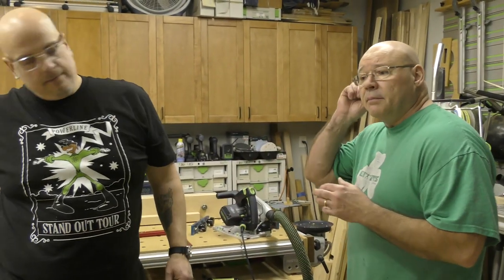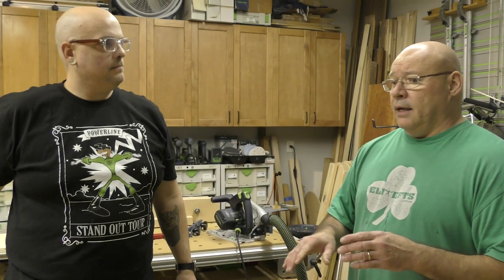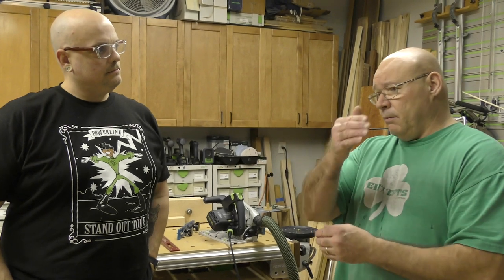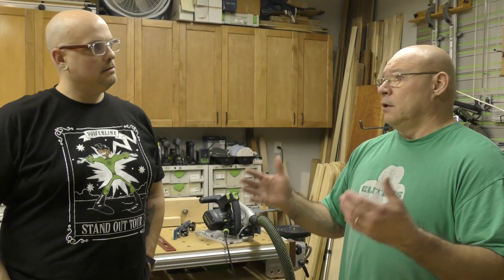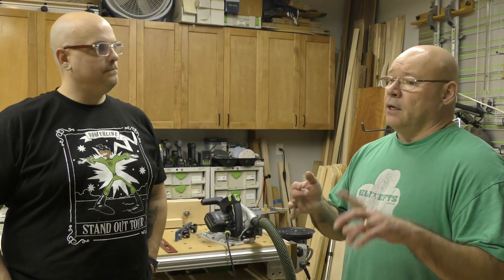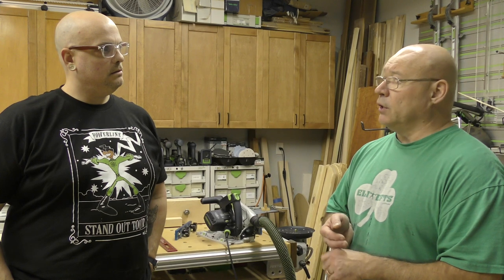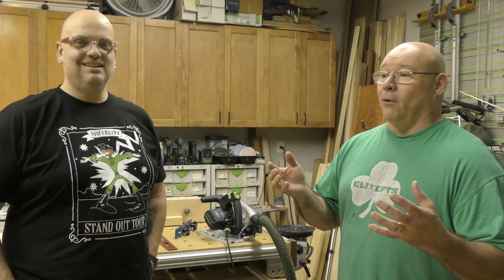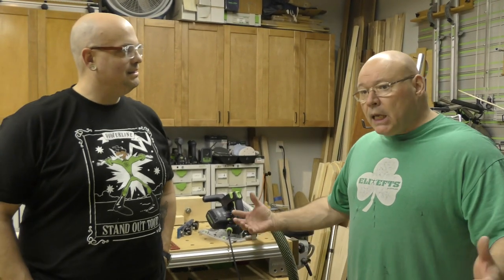And I'm gonna say this 100 times during this video. It's the process of making your panels. Assembly is gonna be absolutely nothing. The time consuming part is perfect parallel rips, making sure your cross cuts are 90. So now we're gonna go into edge banding. We're gonna trim it, and then we're gonna punch the 32 millimeter holes. And after a while, your head's swimming going, when are we gonna end up with a cabinet?